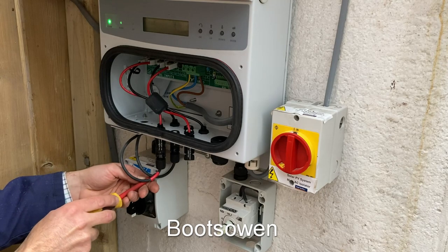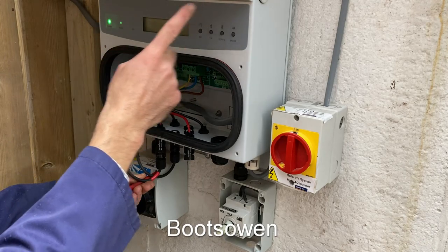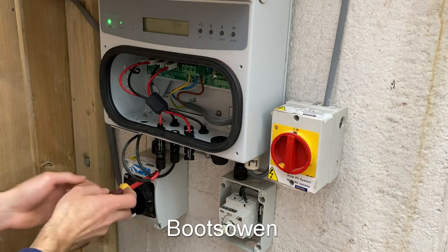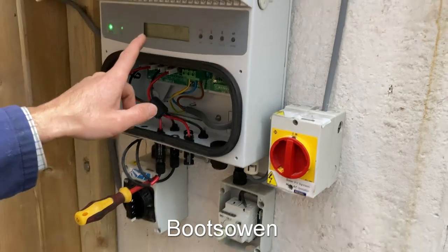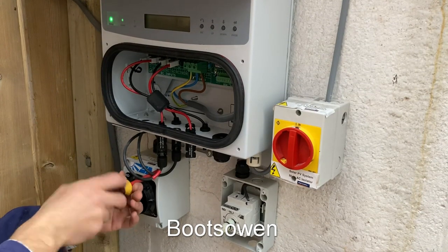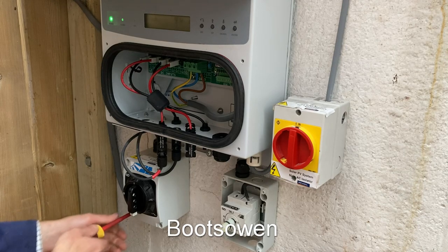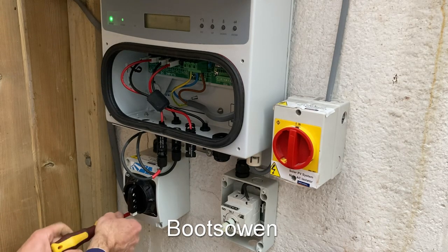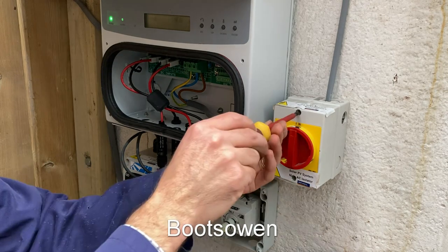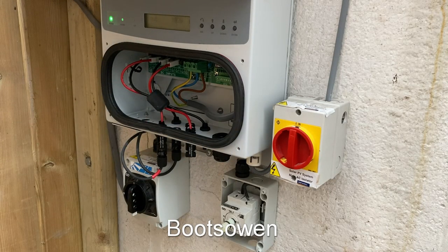The plan in time is to take Andy's advice and to put a little cooling fan blowing air just up through these fins. It's got quite good aluminium cooling fins up here. You see them there? So they should keep the system cool, keep the inverter cool, but equally a little fan would only help. Granted, it's gone up to 98 watts. Granted, the fan itself needs to be under what you're generating. 100 watts, 101, 99, we're back again.